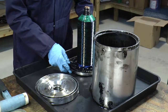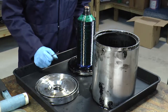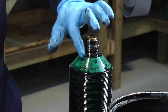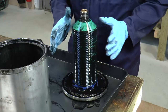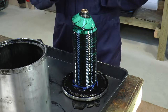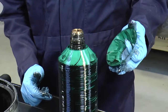We now have the distributor plate with the bowl discs and bearing tube open. We don't need to actually clean the bowl discs — they're designed so that all the sludge doesn't stick onto them — but we should check the o-ring at the top to make sure there's no damage and it's not brittle, otherwise it will need to be replaced. If sludge does go into the bowl discs, slide them off the top, clean and wash them using a biogen active product, making sure not to use anything abrasive which can damage the smooth surface of the bowl discs, then replace.